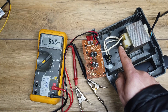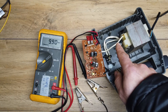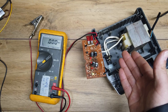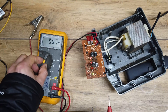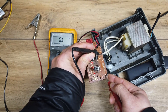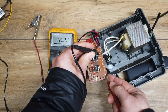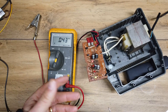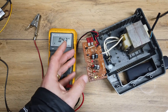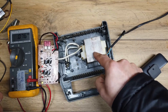I've got a feeling that this transformer over a period of time has dropped in voltage, and I don't understand quite why that might happen — I'd be interested to know if anybody knows. The coils sort of look as though they may have gotten warm at some point. It does appear as though the transformer has actually lost voltage. We did check this earlier and said 12 volts should be all right, but really we need 14 to 15 volts coming out of that transformer in order to charge a car battery, and that's quite possibly why this circuit is malfunctioning. I've done basic tests on the transistors and checked the resistors — that all seems fine. The fuse isn't blown. It really is starting to look like it's this transformer.